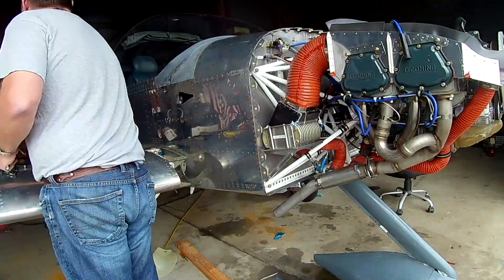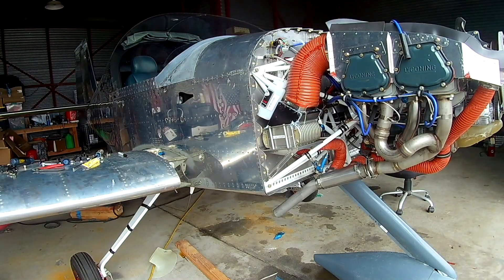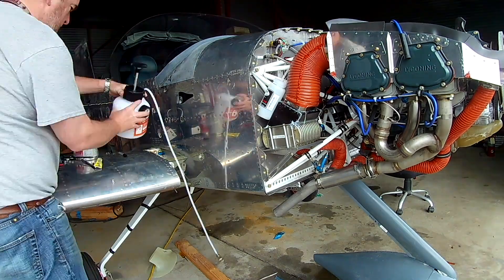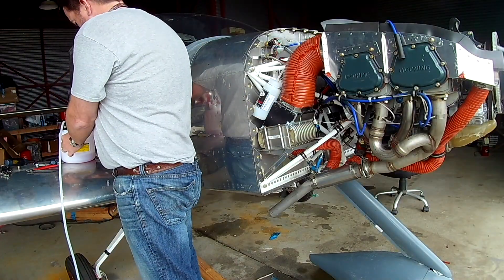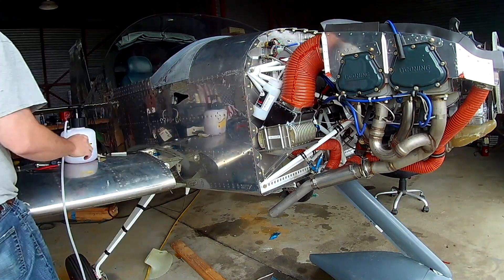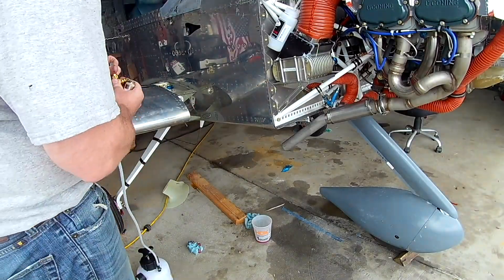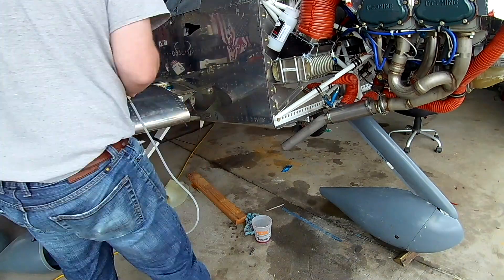In the last video you saw us start the motor up, try to advance the throttle a little bit, and it tried to lurch into my friends and turn them into baloney. Why? Two reasons: one, the right brake is as soft as dough, and two, neither one of the brakes are actually broken in — so although the left brake wanted to hold, it wasn't really holding much at all.